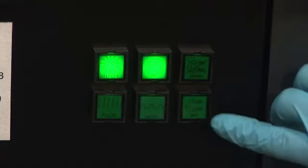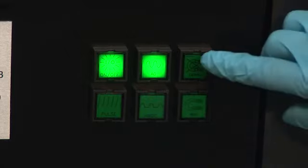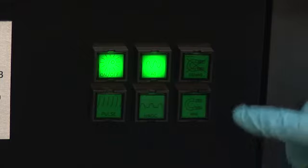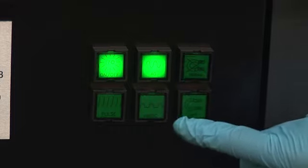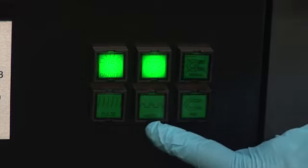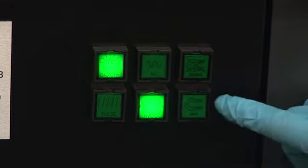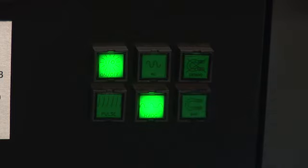The front panel contains the Magshot button, and just above it is the demagnetization button, which initiates automatic demagnetization by decaying alternating current lasting just a few seconds. For choosing the desired form of current, there is an AC button and a half-wave DC button. After pressing either, the button lights up to signify which type of current is active. Even when DC is chosen, there is no need to switch to AC for demagnetization — pressing the demag button starts the AC demagnetization cycle and then switches back to DC automatically.